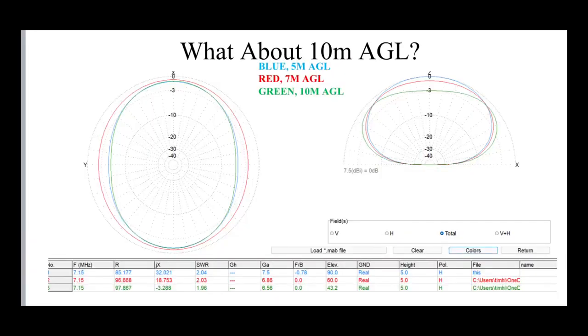Ten meters is beginning to reach or even surpass the limits of lots of amateurs in semi-urban or semi-rural environments. Maybe you haven't got the ability to put both ends of the antenna up at that sort of height, or maybe you've got neighbors close by. For many of us living in fairly close suburban areas, it's hard to get the antenna up much more than 10 meters above the ground — and we're still only a quarter wavelength above the ground. That green pattern is basically what you'd see on 20 meters if the antenna were 5 meters above the ground.